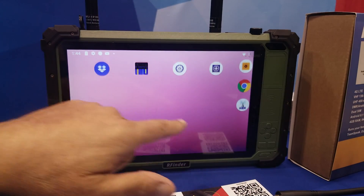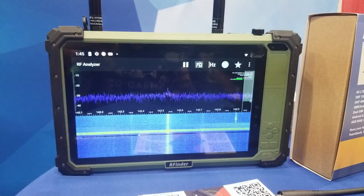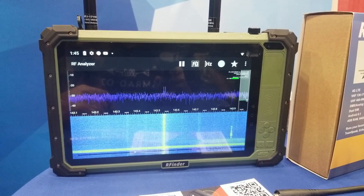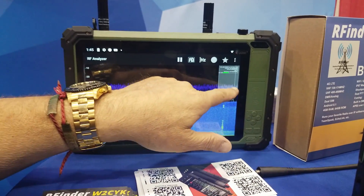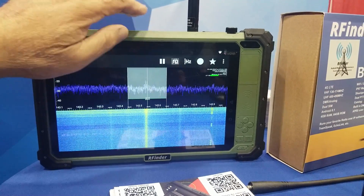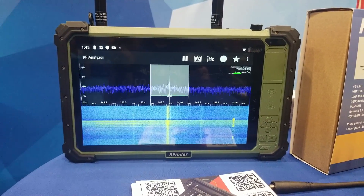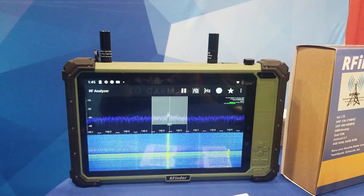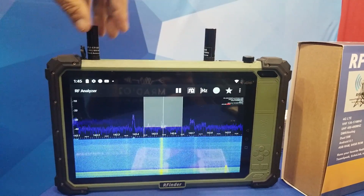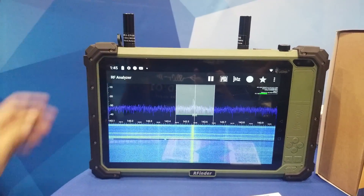That's the RTL-SDR driver. If you bring up RTL-SDR, we're decoding FM right now. RTL-SDR covers basically all of shortwave, HF, and everything. How far up will it go? Right now the way it is, it'll go up to 1700 MHz, but there are parameters you can set to change its upper and lower end. The second antenna on the right is the one receiving for the SDR. This one is for the DMR radio — it's dual band, two meter and 440. I just happen to have a short MFJ antenna on it right now, but you can attach an HF antenna or whatever you need to.